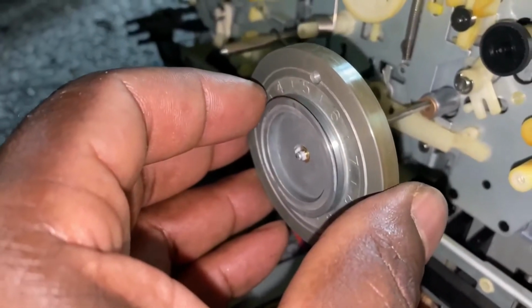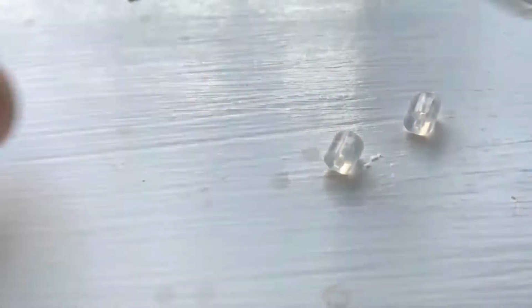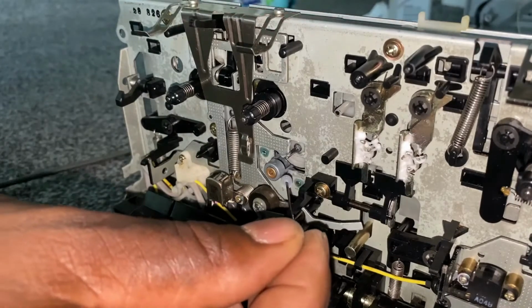And here you can see me just putting the drive wheel for the capstan back in. Just put it in partially for the moment, because I've got to make a new feed roller, as the other one would have perished. I've got this bit of silicone pipe which I'm going to use. Just cut the 2 sections down. These will be the actual drive feed rollers for the idlers.